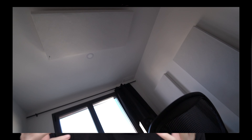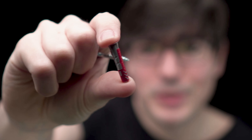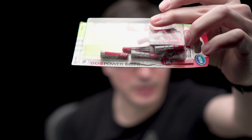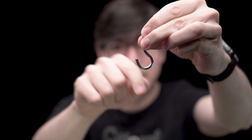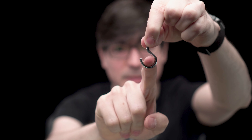Mounting a panel on the ceiling was a little more complex. For the ceiling I had to use a stronger wall fixing — I really recommend this brand, Fischer, specifically the one called Dual Power. The panels have four hooks so you can hang them vertically, upside down, or horizontally. That way I could bring the panel to the ceiling and put the wire inside the hooks, just like a regular painting would hang on a wall.